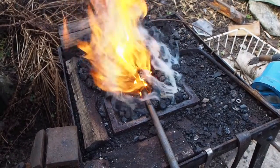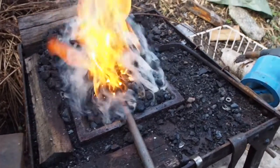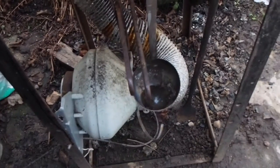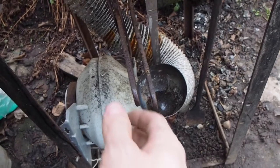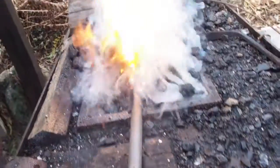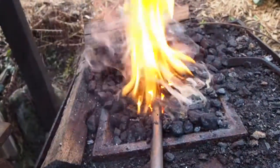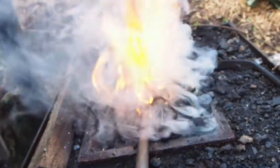The fire nest has been established and there's some coke inside now, so we can start heating some steel. You can see there's very little air coming into the fire right now — there's not a lot required. That's the difference between full blast and all the way off, so we're just turning it up ever so slightly.